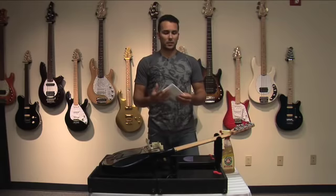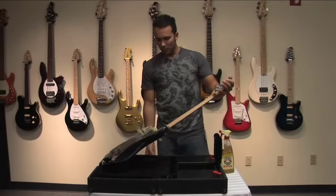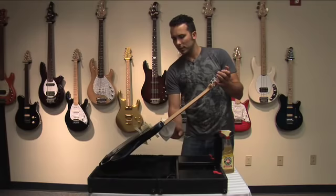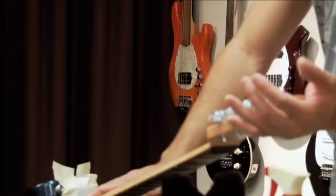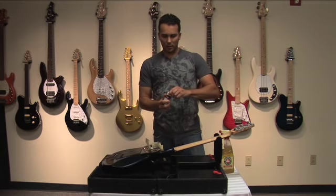On the heel side, you're going to do the same thing. It's good to take a nice clean towel, wipe off whatever's left from the six hundred grit, and move on to your thousand grit and do the same thing, making sure to sand everything until it's nice and smooth. Be very careful around the headstock and the heel of the neck. Once you're done, take your clean paper towel and wipe off all the excess. You should be able to feel your neck now — it's nice and smooth and it's ready for the gunstock wax.